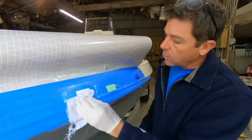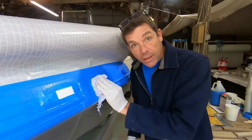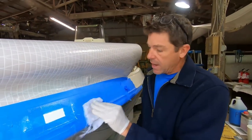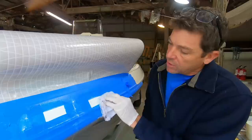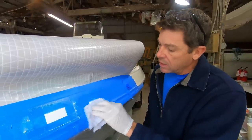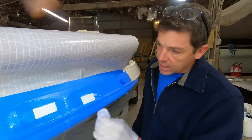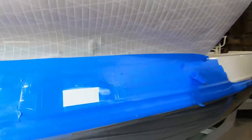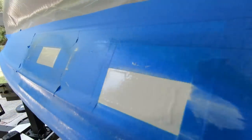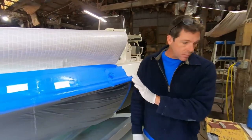If you do the PVA in a thicker application sometimes it'll peel off almost like your skin would peel after a bad sunburn, but for the amount we put on there, just wiping it off is the way to do it. There are several different ways we can approach fairing out or shaping this gel coat. If you come over from this angle you can see it's got a few little ripples or irregularities — they're not terribly bad, but they're certainly not good enough for this really nice boat.